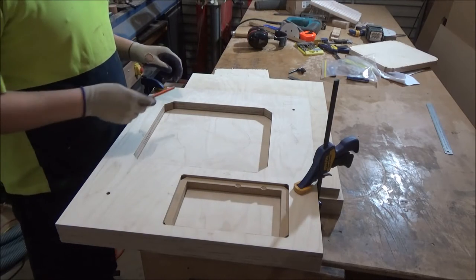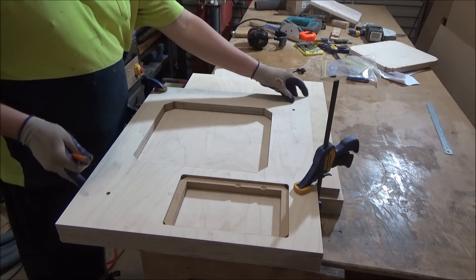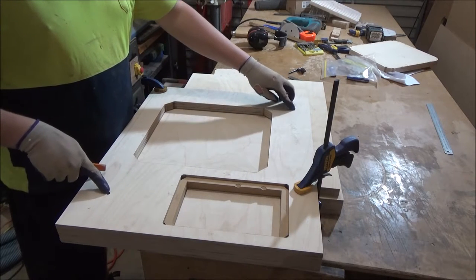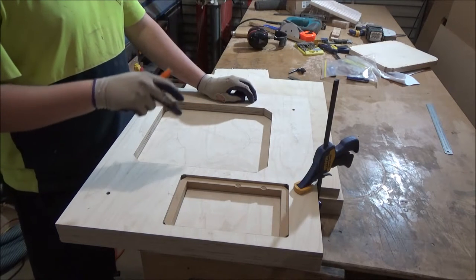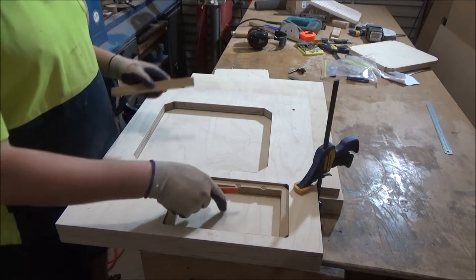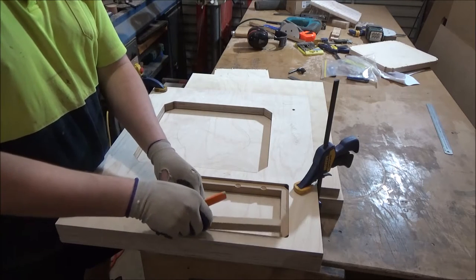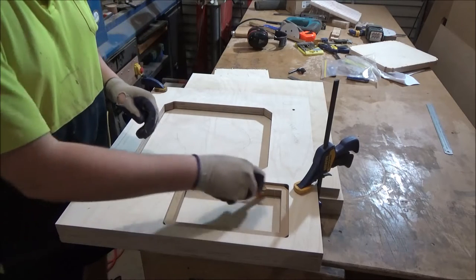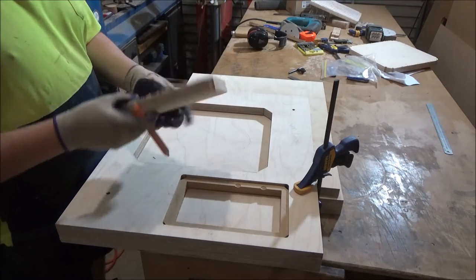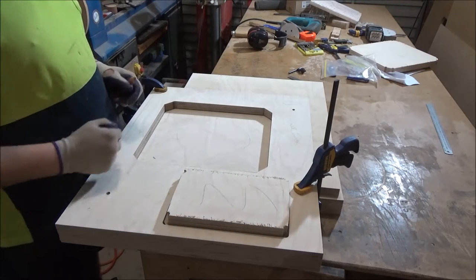I've got the first layer done and that's all good. I've got that clamped to the third layer flush on the front edge and left edge. I've drilled a hole all the way through the second layer into the third layer and I can put a dowel through there - that'll pin them together and I can use the second layer as the template for the third layer. Over here this cut out needs to be slightly smaller, so I've made a bunch of 15mm strips to set in there, then I can mark it out, cut it with a jigsaw and clean it up on the router. Later I'll make a plate that fits inside there perfectly in the second layer and sits flush - that's where he'll put his pickup arm.